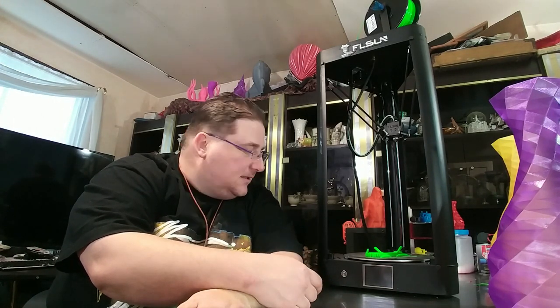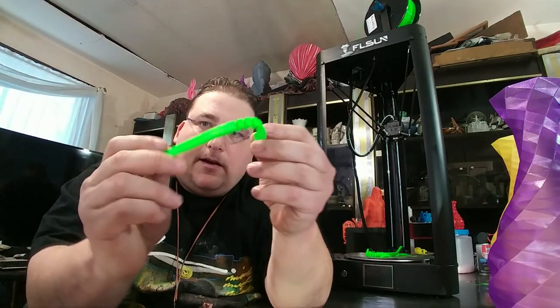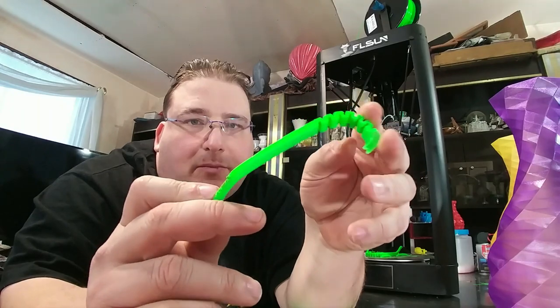And then I decided to start experimenting. I tried to print out a pair of the glasses, and I tried it with ABS, and it actually worked great. It stuck down fine. It did not try to peel off. This thing can get very hot. But ABS did not like bridging. Yeah, it does not bridge, period. I now realize with doing my other prints that ABS does not bridge well. It's very unhappy about it. When you have a completely unsupported bridge, you can get away with that with PLA. You can't with ABS. But what it did print before it got to the bridging part looks great. I mean, it stuck down fine. The quality is good. Nice clean prints. I got no complaints.